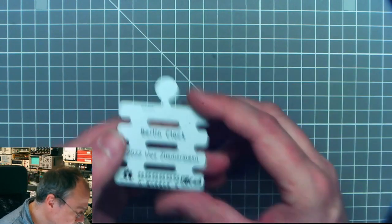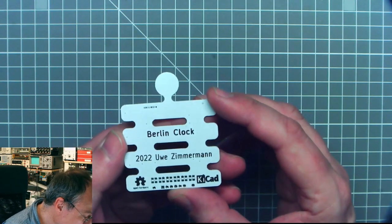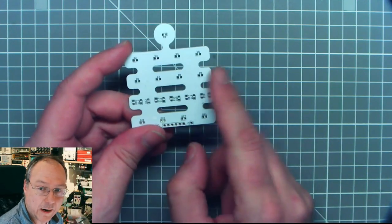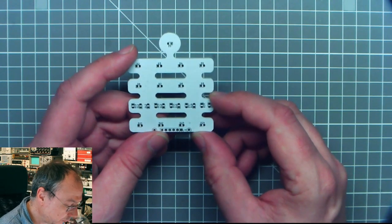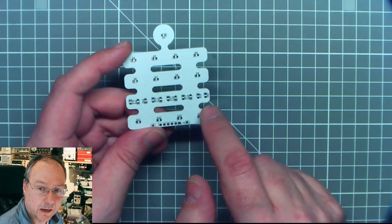Looks nice. Here they printed their serial number, their own serial number. I chose a white solder mask on this board in order to have some back reflection of the LEDs, which will be mounted on these positions here.